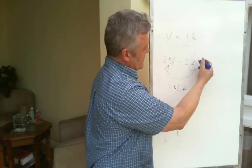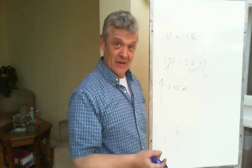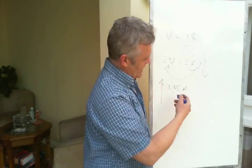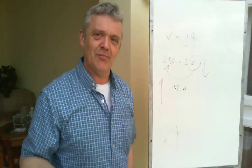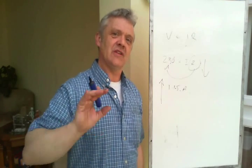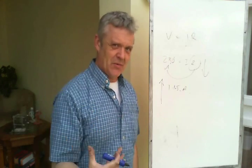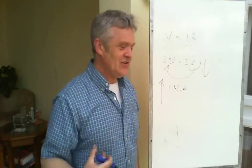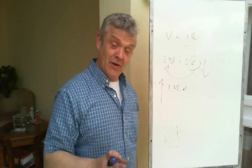So as your resistance goes down, your current is going to go up. If you increase that current too much, it's going to exceed the ability of the material to handle that current draw. You need to pay attention to that when designing these things — think about what kind of power it's going to draw, and what kind of current it's then going to draw.